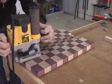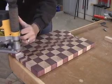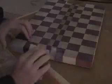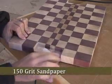And finally I use an eighth inch round-over bit to ease all the bottom edges. The areas that I can't reach with the router are rounded over with 150 grit sandpaper.